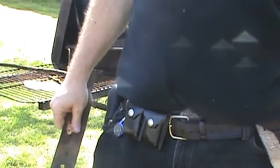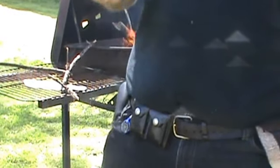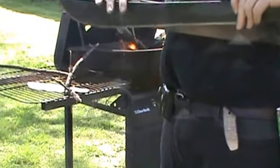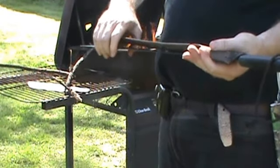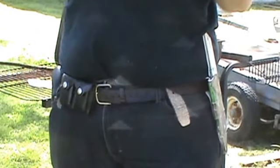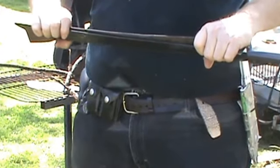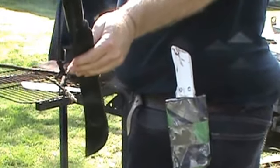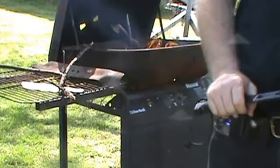All this is about made out of lightweight tin. Most machetes are made out of this stuff. I'm going to make it out of this carbon steel and use it for a pattern. It's almost the same length on the blade, just the handle would be a little bit shorter, about 4 inches less, not a whole lot of difference, some. But this one will be a lot heavier cutting machete than the other one.